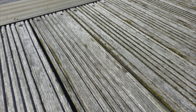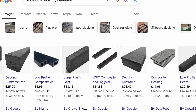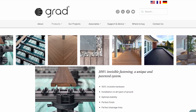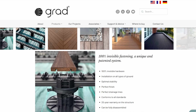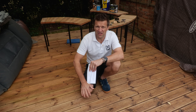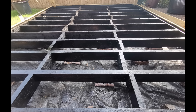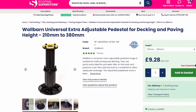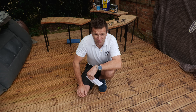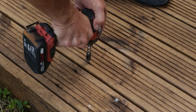A lot of marinas are still sticking to hardwood pontoons. Getting the substructure right is critically important — composite substructures exist, and there's an utterly brilliant aluminium system that was used for a screwless hardwood deck, interesting that they've gone with an aluminium/plastic substructure but still sticking to natural wood. Wooden substructures are still very much the norm, and whilst I use bricks for foundations it's worth remembering pedestals also exist and can extend a pretty long way if you're planning a raised deck.